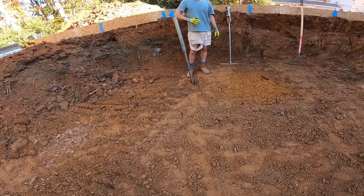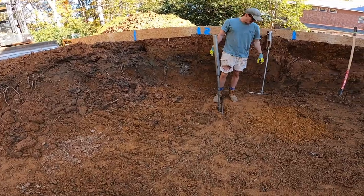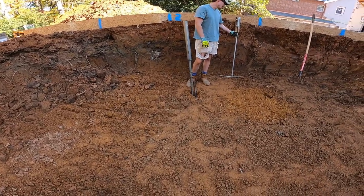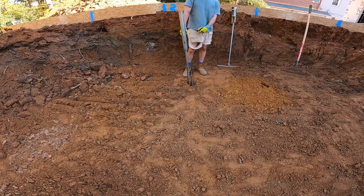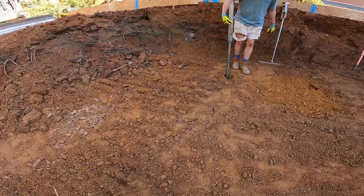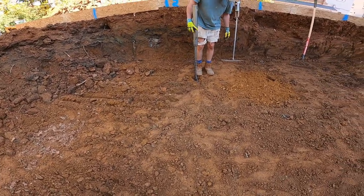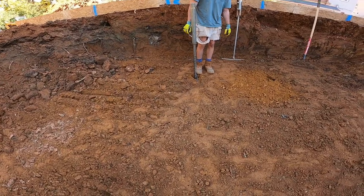Anything over 5 foot, you would probably recommend pylons or piers. Sometimes you'll be boring down 3-4 feet, and you can still see water getting in the bottom of the boring, and you're like, probably gonna need timber piles. Yep. Damn. Like a water table or something like that?